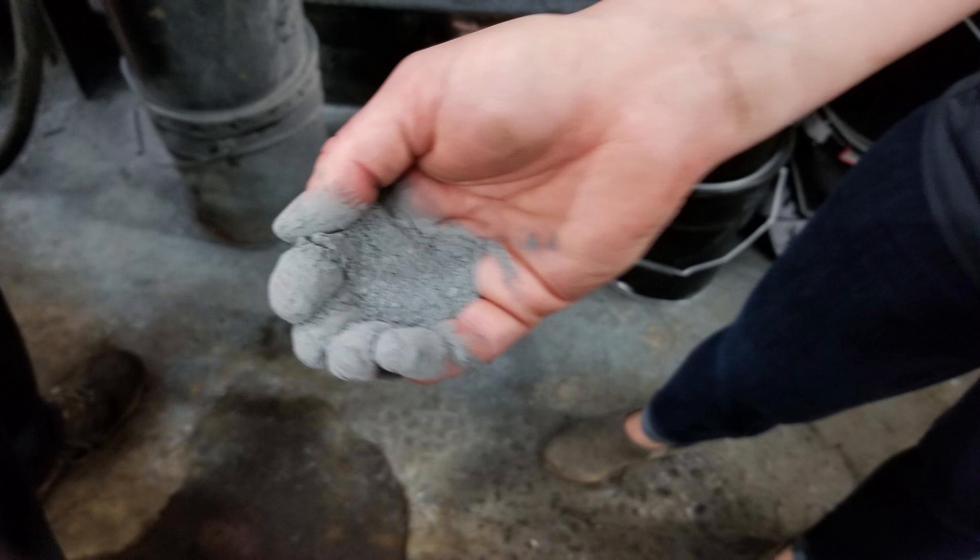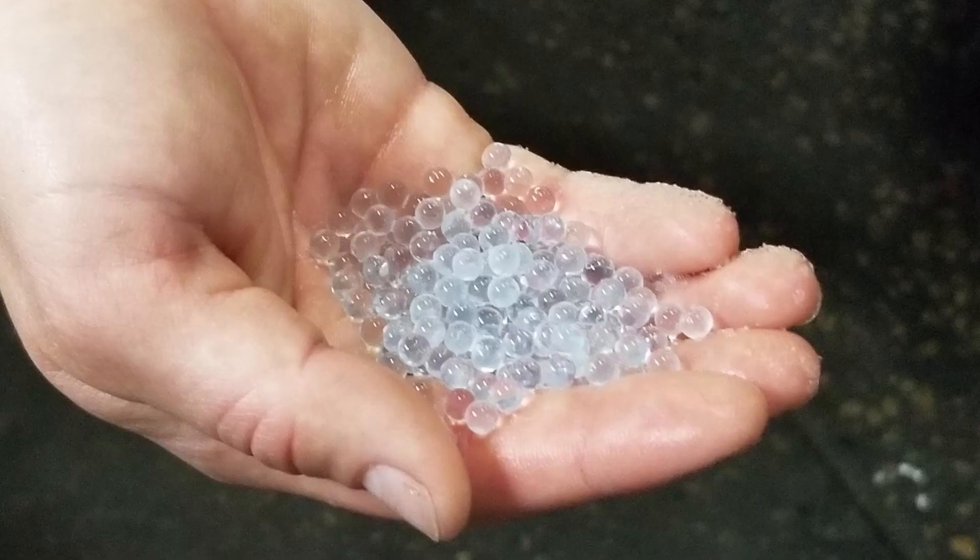In contrast, our galvanizing lines use chemicals in the mechanical barrels to dissolve zinc powder. Then, these glass beads, which are mixed in with the metal parts, actually pound the zinc onto the parts as they collide with each other while they rotate together in the barrel. And that's how the Ultimate Zinc Plating Company makes a deposit.